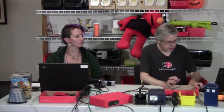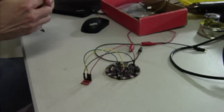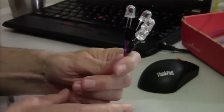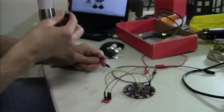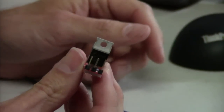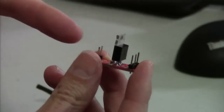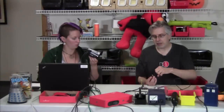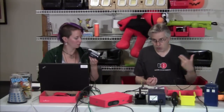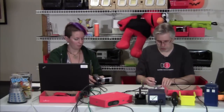The next thing we're going to do is hook up the LEDs. Because these LEDs are kind of high-powered ones, we can't just run them off of a normal Arduino port. So what we're going to use is this cool little board that Nate actually designed called the Power Control Kit. The Power Control Kit has a big transistor on it called a MOSFET. What a transistor does is it switches larger amounts of current for you — it's kind of like a relay. Basically you can put a small control voltage into the MOSFET saying turn on please, and the MOSFET turns on like a giant switch and lets all the current flow. I think this one's good up to 4 amps, though we'll use maybe a couple hundred milliamps.